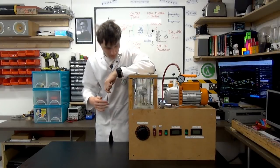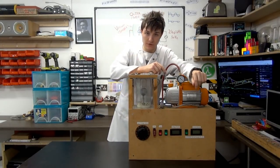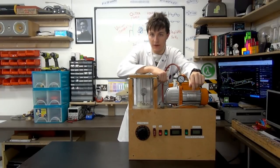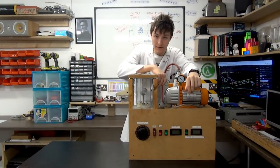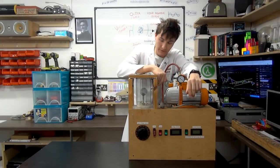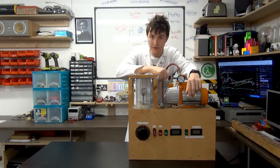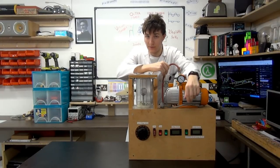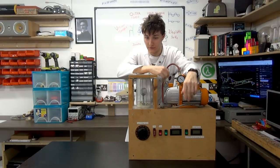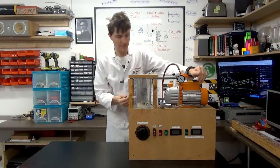Now, the reason I don't want to upgrade this to a fully working fusion system is because, for a start, deuterium is quite expensive and hard to get hold of. But even if I did put it inside here, you would be getting so much fusion that you would be emitting enough neutrons that it becomes dangerous. You would be producing quite a fair bit of radiation, and so the entire system has to be encased in stainless steel. Stainless steel vacuum chamber, stainless steel